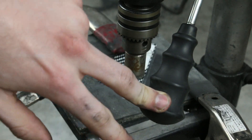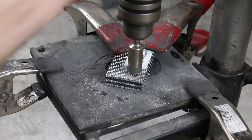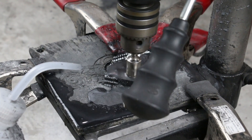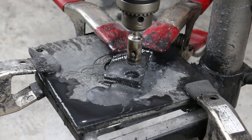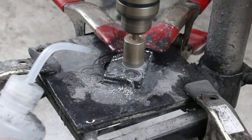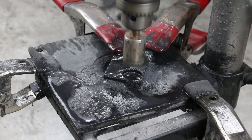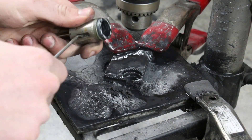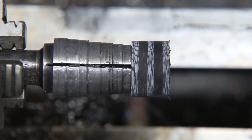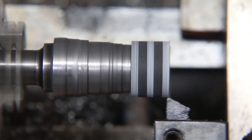Now it's time to add the carbon fiber liner. To cut out the piece of carbon fiber that we need, I'm going to be using these diamond-coated hole saws. Now I've got the piece cut out and it doesn't quite fit inside the other half of the ring — and that's good, that's how we want it. We want to trim this to exactly fit and not quite go on easily; we want to use that press to give it a nice press fit like we did earlier.